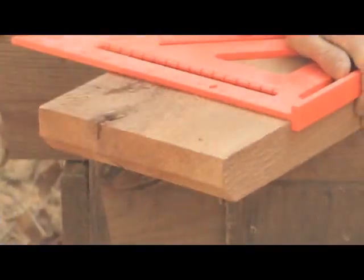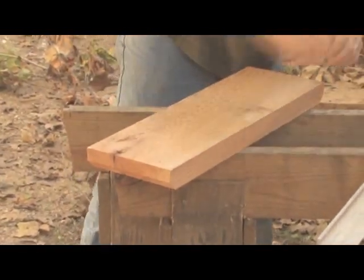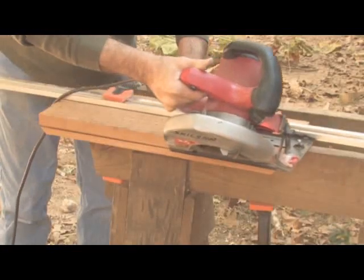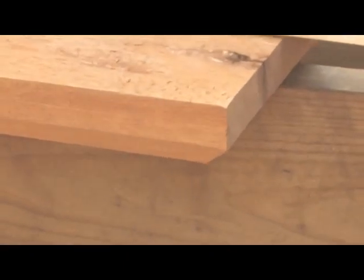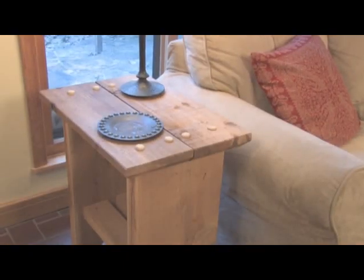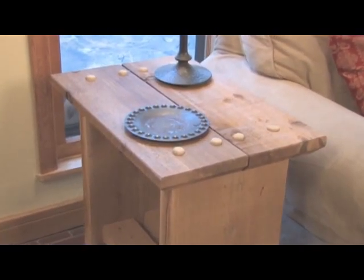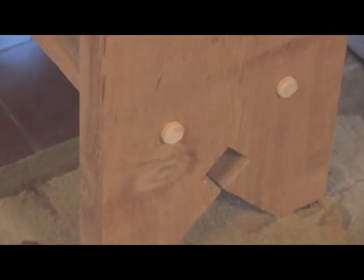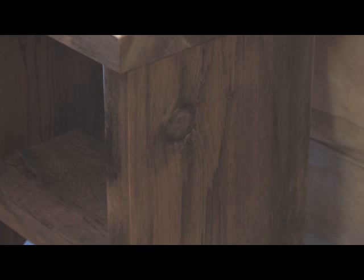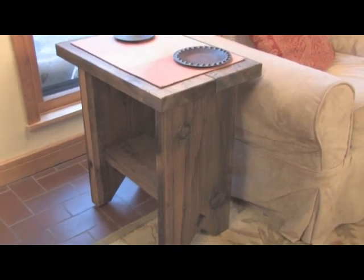I clamp a guide piece to the parts of the top to guide the saw accurately. First cut the ends and then the sides, leaving the edges that align in the middle of the table uncut. You can also add interest and craftsmanship to your tables by using large dowels to connect the parts. Assemble the table using wood screws in place of the pole barn nails, then you can remove the screws one at a time and replace them with seven-eighth-inch dowels glued in place. You can give your tables an almost instant weathered rustic look by spraying them lightly with a diluted ebonizing solution.